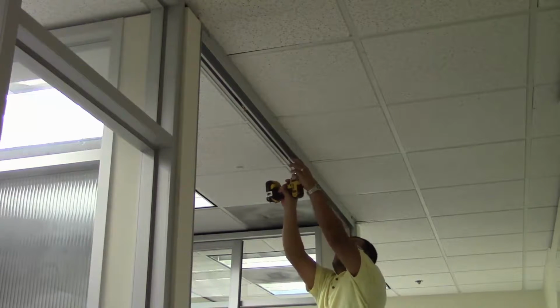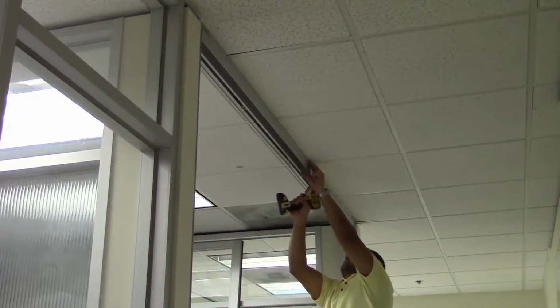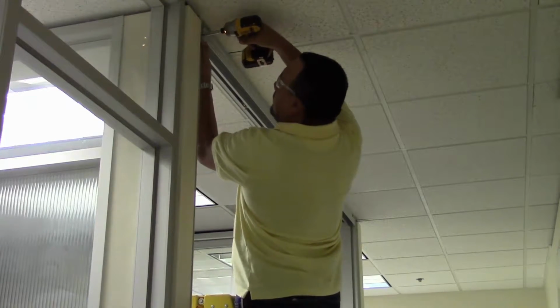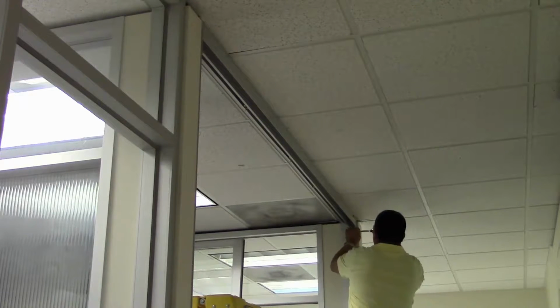Now remove the sliding door track by retracting the screws that attach this component into the wood blocking above. Then, with support from below, remove the C100 header clips on both sides of the outside vertical jambs. Once all 4 clips have been removed, slide the track down out of the opening.